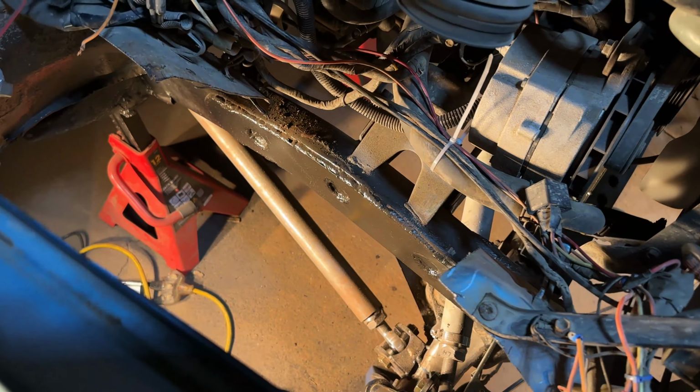I'm also able to close the hood and we have about 2 inches of clearance there, which gives me enough room to put a crossbar between this side, the driver's side, and the passenger side to really stiffen those up from moving around. And I just cycled this whole suspension from full extension down to full compression, and this shock is looking good. We have no contact with the frame. One thing I was a little concerned about with the full travel here, which I think we've been able to avoid, is that the panhard bar is gonna come into contact with our steering or with the axle housing itself.